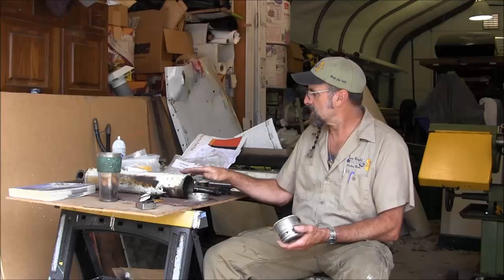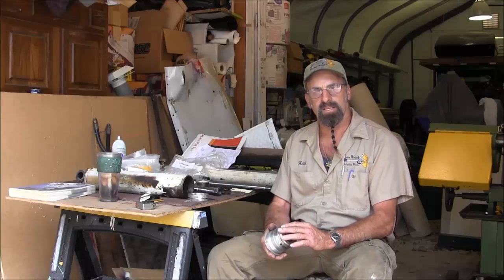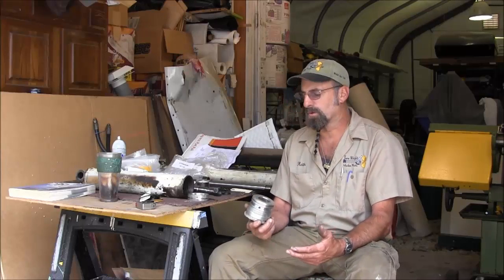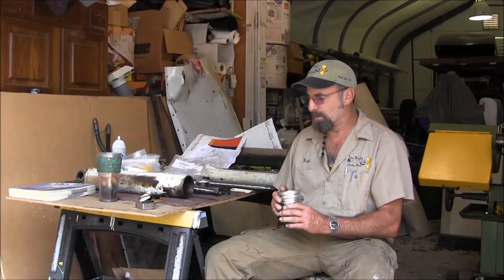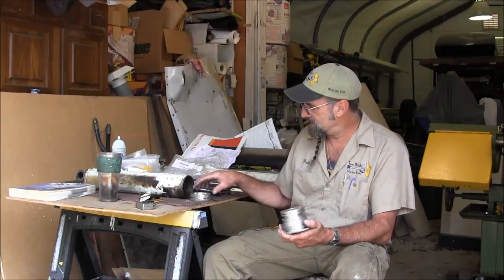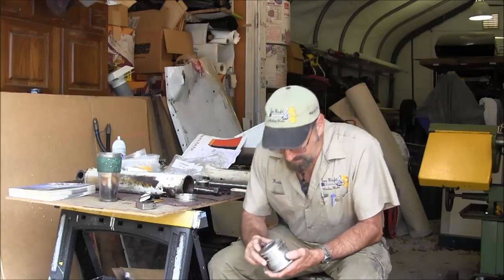This one lifting cylinder here, both of these really, had a lot of filth in them. Somebody actually got a lot of debris inside the hydraulic system on this tractor. I don't know if something let go in the hydraulic system, or if it was dirt or grit, but even the piston and the cylinder seal cap show matching scoring where grit got in when this came fully open, and there's scoring that will have to be polished off.